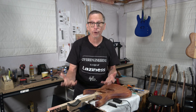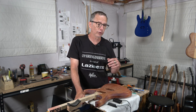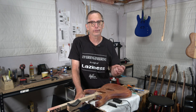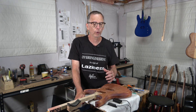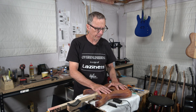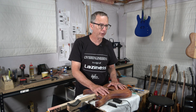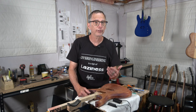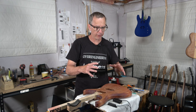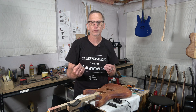A good example is a fretboard. A fretboard has to be made out of very hard, dense wood because it has to hold the frets in place. So we typically use rosewoods, ebonies, hard maples — that sort of wood. I like to use woods for the body that are light in weight but still durable enough to resist dings and scratches and easy to work. So I do a lot of research to select woods for the body, neck, and fretboard that are going to serve those purposes well.